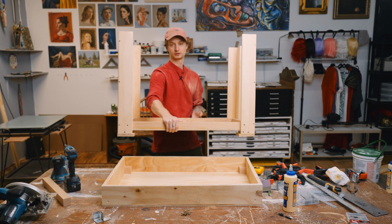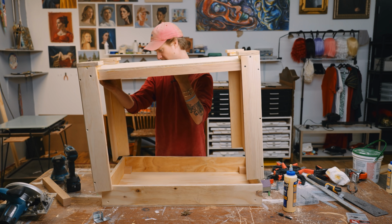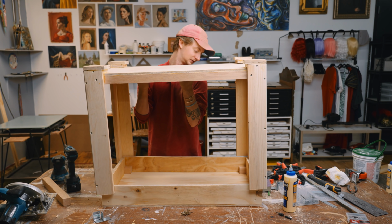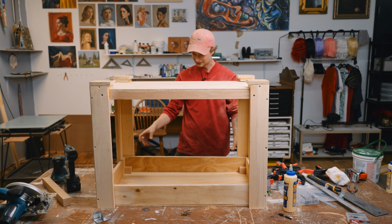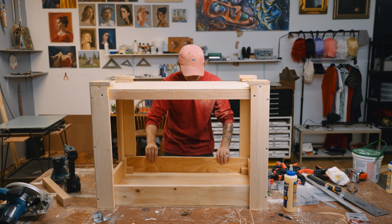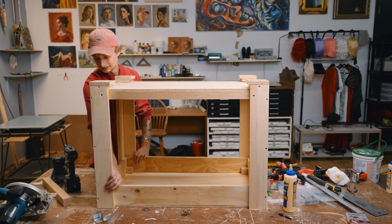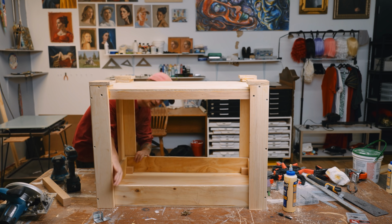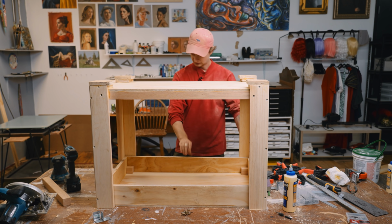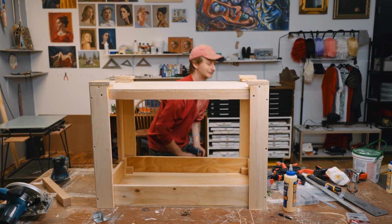So this is how it should be, but we're gonna see if this fits. This is kind of the moment of truth. It should be able to wiggle a little. Oh, easier than I thought. So my tolerances aren't perfect, but you know, a millimeter or two on each side, the wood will just suck up, so suck into itself without cracking. So like right here, it's kind of hard to see, it's gonna suck in, but that's pretty darn good. More countersinking and more drilling and glue.